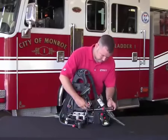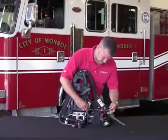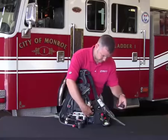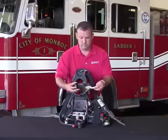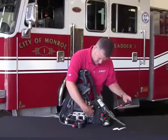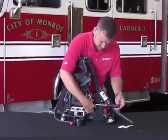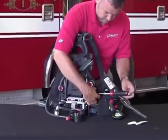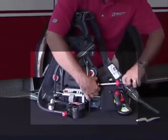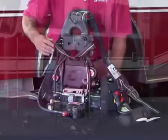The AirPak X3 is shipped with batteries pre-installed in the Pack Alert Sensor Module. To prevent accidental discharge during shipment, a caution label is inserted between the batteries and battery cover. To remove the battery cover, use a large flathead screwdriver to loosen the battery cover screw. Reinstall the battery cover, taking caution not to over-tighten the screw. The lights on the console and sensor module will illuminate temporarily as part of the battery installation process.